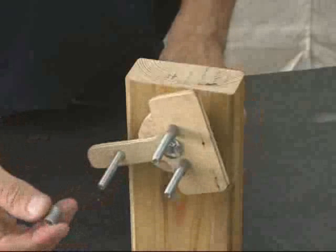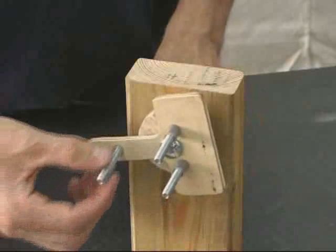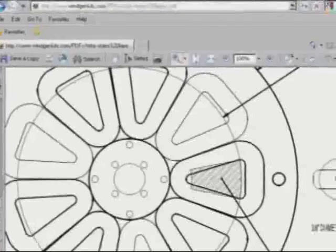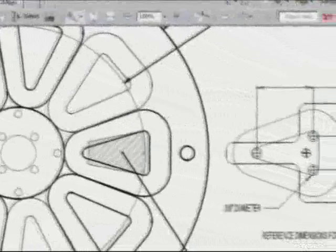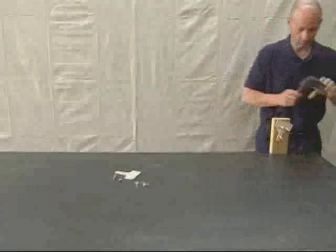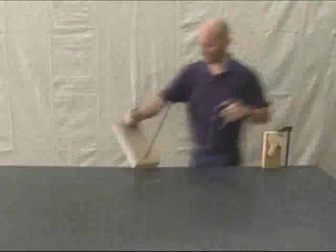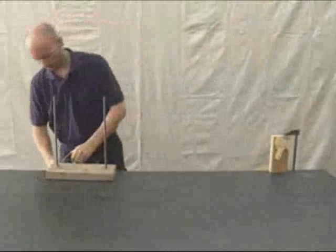The actual size and shape of the coils is determined by the spacing and length of these bushings. Suggested dimensions for this pattern are available on our website. Securely mount the coil winder to a sturdy workbench, then secure a rod to the workbench which will be used to hold spools of magnet wire.